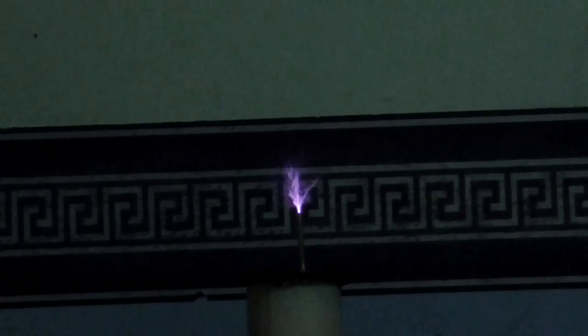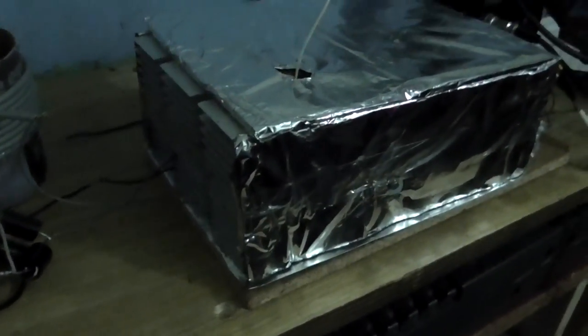However, I've got to remember, I'm running this ballasted. So I could increase the power, and it's even better! I so hope this camera's picking this up well, because my camera doesn't suck, but it doesn't seem to be able to pick up sparks very well. Anyway, next thing I'm going to do, I'm going to leave this capacitor disconnected for now, but we're going to try the full 120 volts that this transformer can provide. So that's going to be about 170 volts DC going into this circuit.